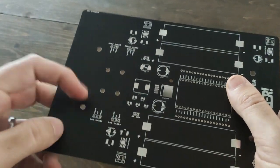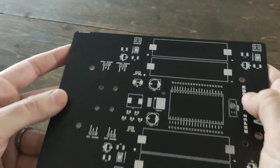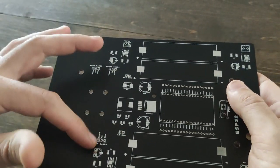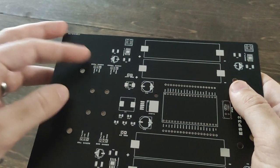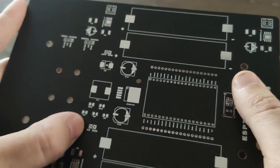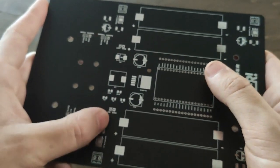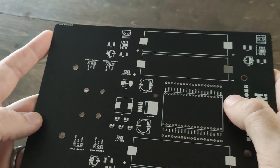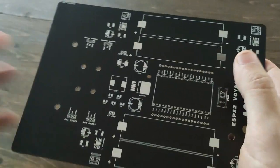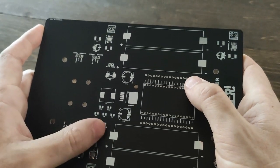We also have breakout pins for four servos. If you wanted to add an extra servo, you could do it with the GPIO pins, but I have four here because that's what I use for my robotic arm. One thing that's really cool is if you're just doing a pan and tilt, you could only use two if you wanted to, and then plug an FPV camera in here since that FPV camera only needs 5 volts. I also have a 5-volt and ground pin broken out to hook up anything you want — like a relay. I actually use this port for the FPV camera too. I know a lot of you may be wondering why I didn't just use the ESP32-CAM board. One reason is the delay with the Wi-Fi camera, and also you don't have as many pins. I really love using FPV cameras because you can still record, travel over long distances, the delay is minimal, and it's a fun, affordable way to add a camera to your project.